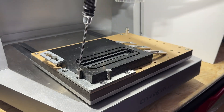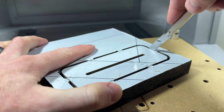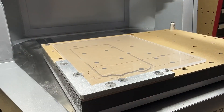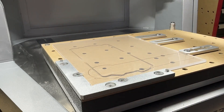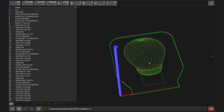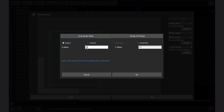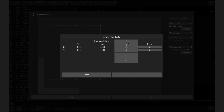Once finished, vacuum the part before removing it from the Carvera Air, then carefully use the hand saw provided to cut away the base from the remainder of the stock. The next part to manufacture is the acrylic display board. Peel the top layer of protective mask off the acrylic before securing the 150 by 180 by 4 millimeter acrylic plate over a piece of waste board as shown in the examples guidebook. Within the Carvera control app, there are multiple acrylic display board files to choose from in the LED examples folder. After selecting a file, preview the design before clicking configure and run. Set the work origin to 15 millimeters in the X direction and 25 millimeters in the Y direction from anchor point 1. Enable scan margin, auto Z probe, and auto leveling with 5 X points, 5 Y points, and a clearance height of 2.